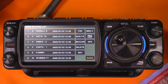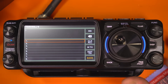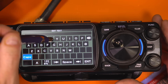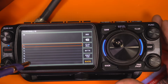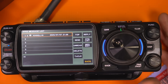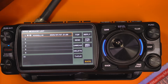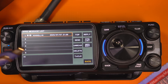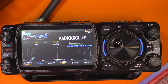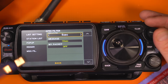Let's go back to Station List — tons of stations. Let's pick one and hit Reply. The cursor is up at the top, and I'll hit the Function button to edit that — I'll just type 'hi' and then transmit it. It was received — that implies it was sent, it went through a digipeater, the whole nine yards. It's beeping multiple times because it's hitting multiple digipeaters and they all just digipeated that message. Very nice — a message went out. Now back to APRS Filter under APRS Settings — the pop-up time of 10 seconds is too long, so I'll drop that down.